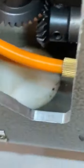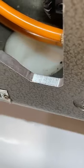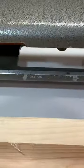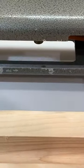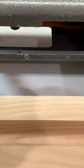And this little white plug that's in the bottom of our machine back here is just not absolutely 100% oil tight. So we'll get a drip of oil out of there, and then we have this whole section in our casting down here in the bottom that is just completely open. So sometimes we'll get some oil out of in here as well.